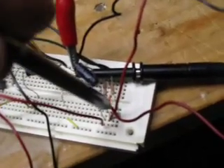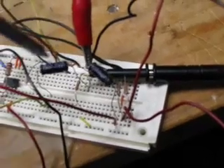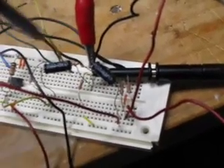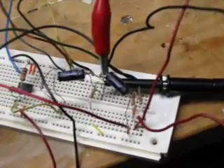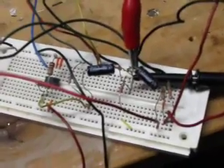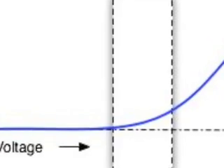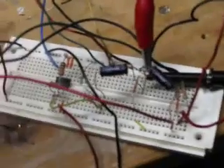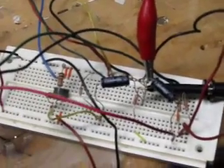The resistors — these two resistors — serve the purpose of combining the two inputs. The capacitors are isolating DC voltages from the inputs and outputs. The two diodes here are giving us a DC offset for the frequency signal going into the diode, so that we can get it to behave in the nonlinear corner of the diode's response range. The op-amp over here is not really part of the fundamental circuit; its purpose is just to boost the output level.